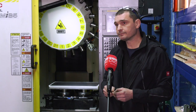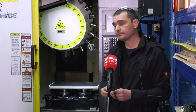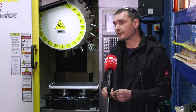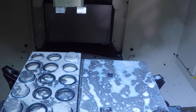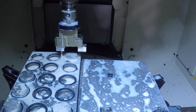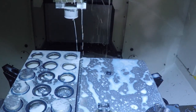You're introducing automation yourself with the tooling and a gripper — can you explain why and how you're doing that? We're using a gripper to allow us to pick parts off a pallet tray, pop them into a vise, machine the component, flip them over into another vise, and then pop them back into the pallet. We can batch anywhere between 20 and 70 components in one go.